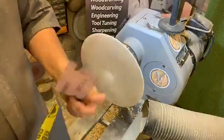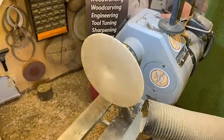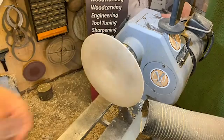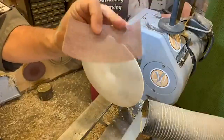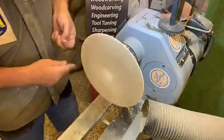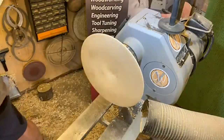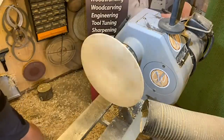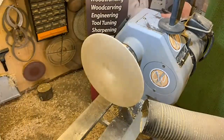Fantastic, both great. If you're wet sanding and if you're turning really waxy materials or oily or even exotic timbers, then go for Abranet all the time. It's a very cool cutting abrasive where the papers aren't so much. But the bulk of my abrasive is always going to be material backed abrasive because it's a little bit cheaper, but that's not the main reason. It's just a little bit more flexible, all those sorts of things. So that's my reasoning. So let's get some airbrushing going.